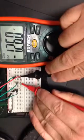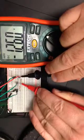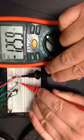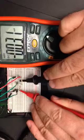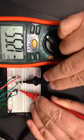If everything is working, it should read about 1.25 volts. And if you look, the voltage across the top resistor is 1.26 volts — so just about perfect. And then the other 1.26 volts, the other half of the 2.5 volt voltage, should occur across this one, the second resistor.